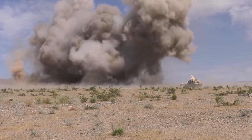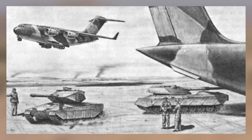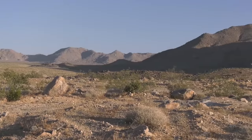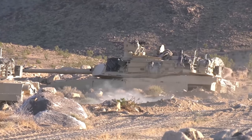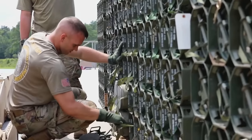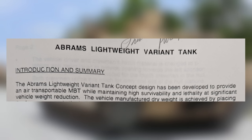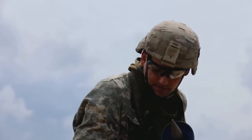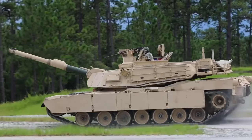However, that comes at the cost of armor. They didn't want to entirely replace the regular Abrams with this variant — this was basically a rapidly deployable light tank version of it. Actually, it'd be more of a medium tank, but many people already confuse medium with MBT, so let's just say light. The goal was to create an M1 that could be reduced to 35 metric tons for transport by C-17, with two M1s fitting in each plane. The design would also be partially modular, meaning that pieces could be taken off and shipped separately to further reduce weight. So obviously these wouldn't be combat ready quite as soon, but it is better than nothing. The M1 was already known for having high survivability and lethality, and they didn't want to reduce that on this design. They decided to achieve this by using advanced composites and titanium. Obviously, titanium and composites alone wouldn't be enough to reach the weight goals — the design of the MBT would need a full overhaul.